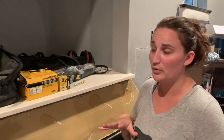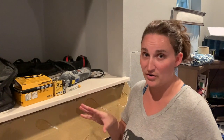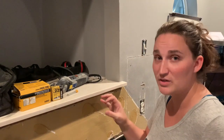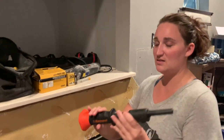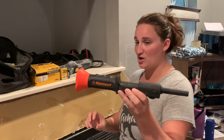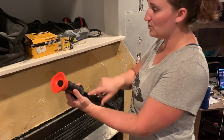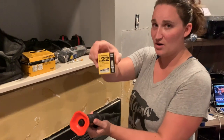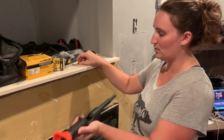To complete the framework, we had to drive nails into the concrete into pressure treated studs in order to keep up to code. And we did that with one of these. It's called a powder hammer shot, and it kind of loads like a shotgun. The round goes in here. You can buy the rounds at the hardware store. The round goes in here and the nail goes in the bottom